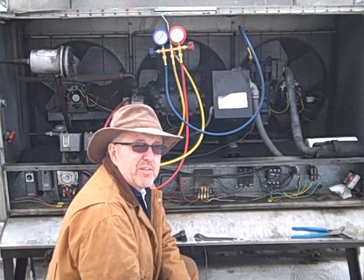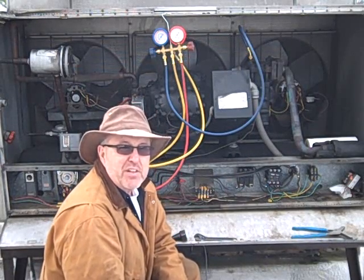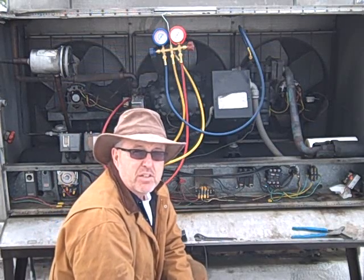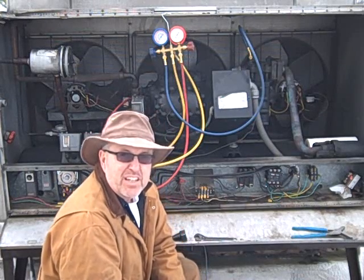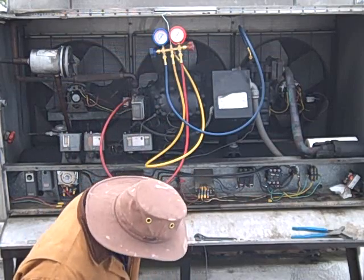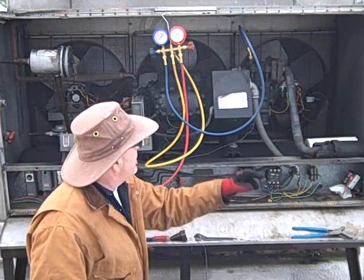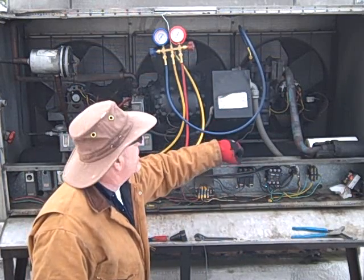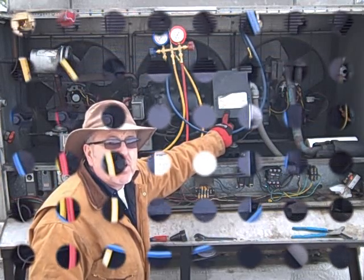Now for a little history — we've been trying to find the leak on this. Downstairs, the evaporator's clean, there's no oil, nothing in the drain tray, so there's no leaks downstairs. Upstairs here, we've got no new oil leaks, nothing on the roof. There's a noise coming from inside the electrical box here. That's where I'm headed — I do believe that's where we're going to find the oil.